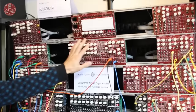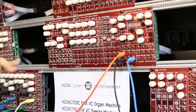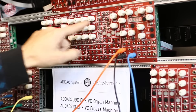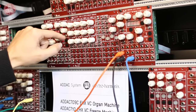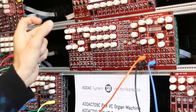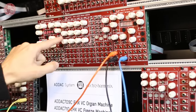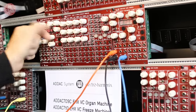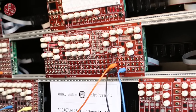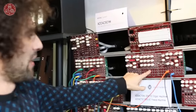The Mille Plateaux is a quad envelope generator with four envelopes. One key feature is that attack and release don't have to start or end at zero — you can start the envelope at five volts, come down, go back up, and come down again, or any mix in between. Each stage — attack, decay, sustain, release — can have a short, long, or externally clocked time. You can also set the shape for every stage, from logarithmic to exponential, in any combination.